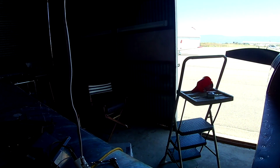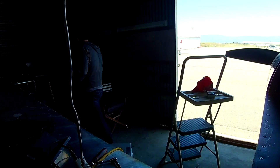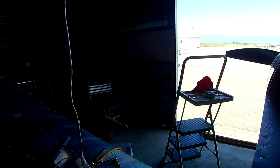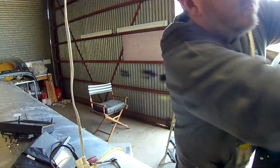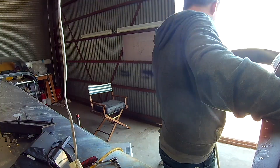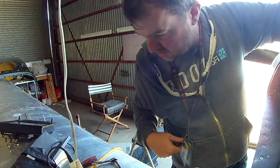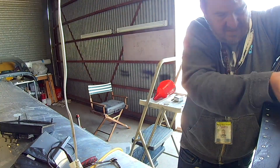It's the left side of the panel that's really the biggie, where the pilot sits and all the controls are. So we've taken it off and I've got my calipers out. The ultimate goal is we're measuring everything and I'm going to have this computer cut, because while I can cut, computers are so much better. I'm making a CAD file — Vans supplies the panel files, thank you Vans, and Garmin supplies their instrument CAD for measurements, thank you Garmin.